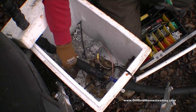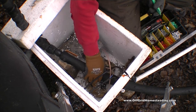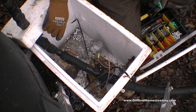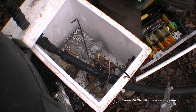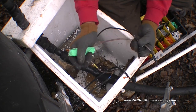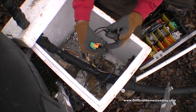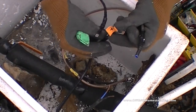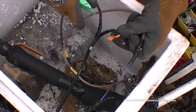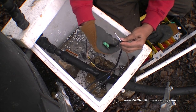I'm going to go ahead and cover these back up, give it a little bit more protection from the winter. I need to come back and put some electrical tape around all this to make it a little bit better. This is the positive wire coming off of the solar panel, this is the negative. I am going to go basically positive to positive to positive, negative through the switch to that. So as long as the float is up it will get power; when the float goes down to the bottom it will shut the pump off. Remember the white is positive on the pump.